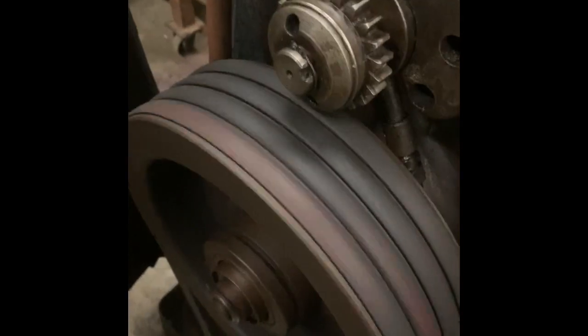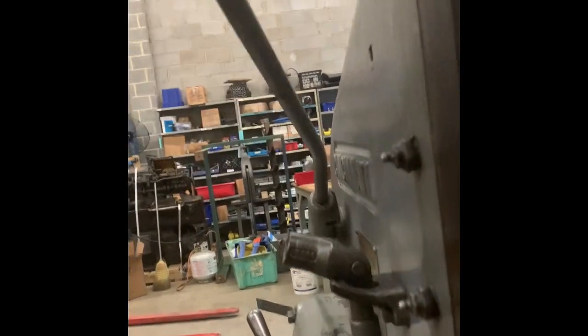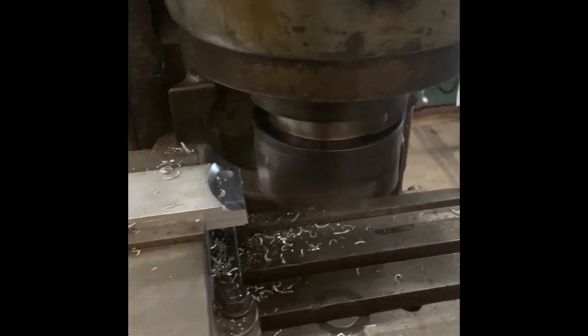I think we can look at the drive belts in here — be careful — four drive belts, there's a coolant pump up top here, and those are four drive belts; the motor is down there. I think it's 10 horsepower. Now we're going to engage it by pushing its lever up until it snaps into this end, and now the spindle is really rolling.